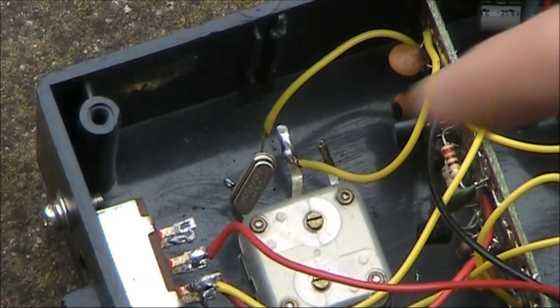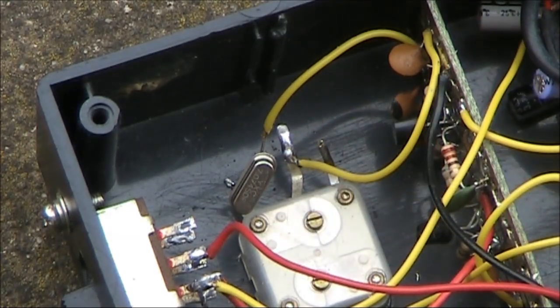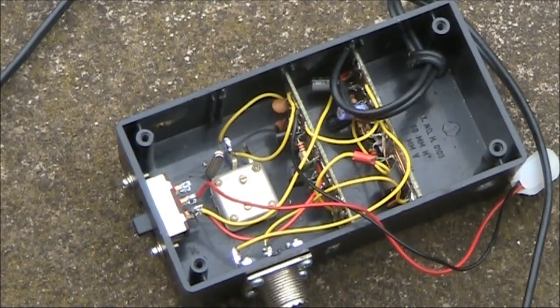This is a close-up of the crystal. I've got it in series with the variable capacitor. The reason for that is I already had the variable capacitor on the front panel, and it's in series with the crystal so it allows me to adjust the crystal to be spot-on frequency. I'll give you a circuit of this later on. I should point out this is a very simple direct conversion receiver — there will be reception of signals on the opposite sideband, so it won't be as good as a single signal receiver. Nevertheless, it gives good results, as you'll see in a moment.